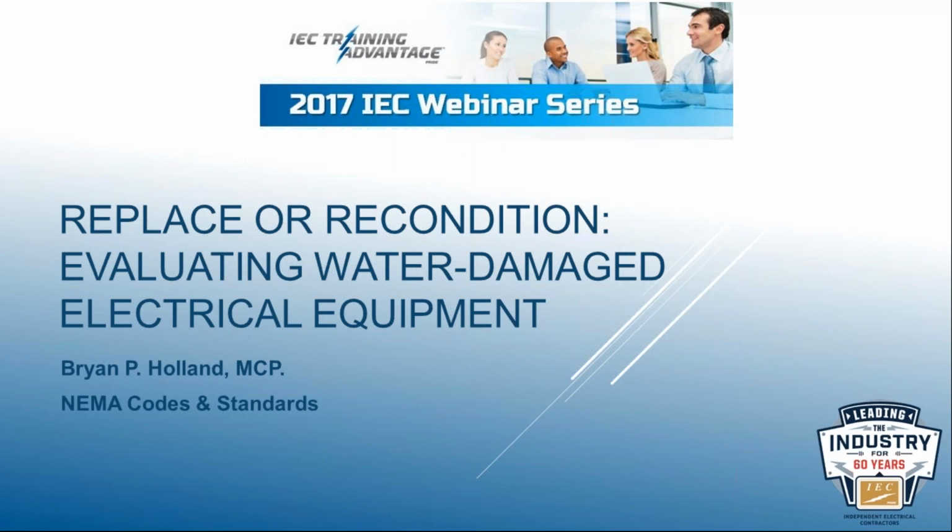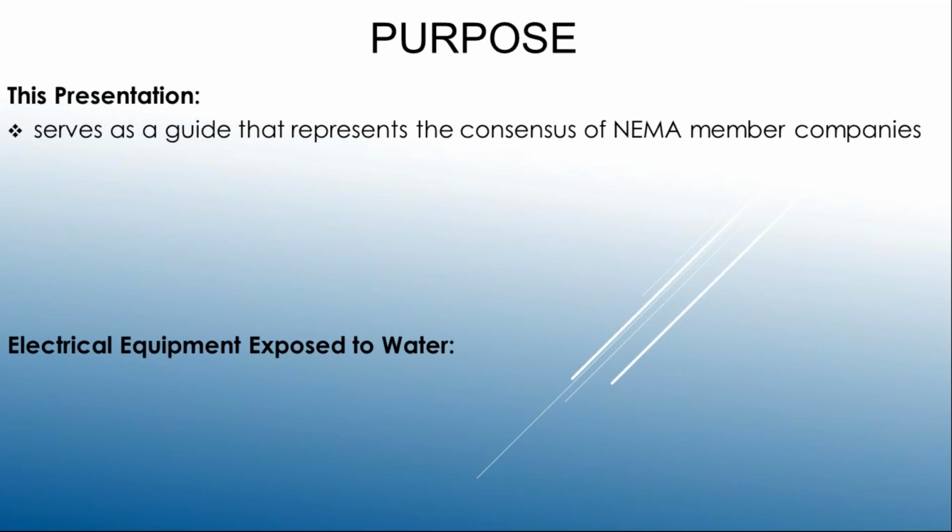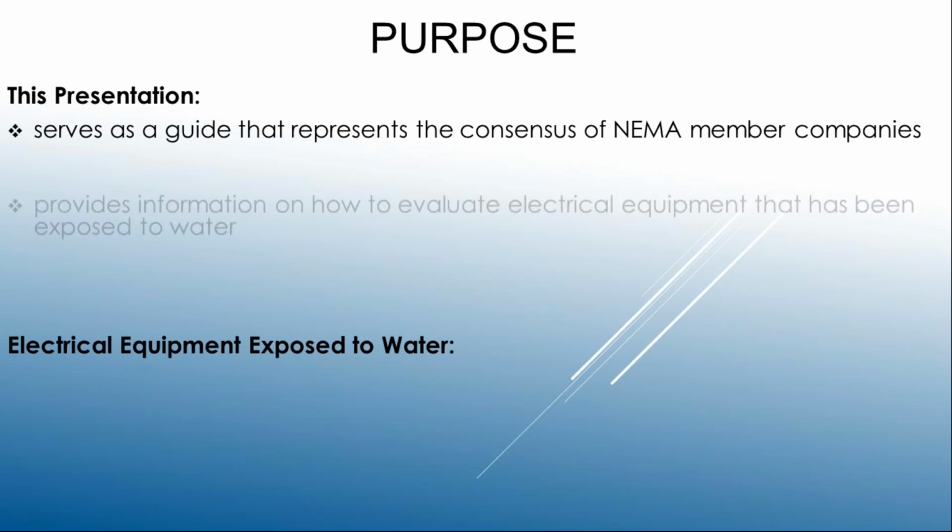So this is a great subject matter to talk about, considering everything that's happened, what we've learned from these most recent storms, and then other flooding events that have occurred in recent history. So again, this being a NEMA IEC joint presentation, most of the information that you're getting here is from the NEMA member companies. These are the manufacturers of the equipment that do all the R&D, all the certification testing, all the installation instructions. They understand their products better than anybody and know what they can withstand and what they can't. So this is their consensus understanding of what that evaluation should entail, and then what equipment needs to be replaced with no further thought, and what equipment can be reconditioned with certain considerations.